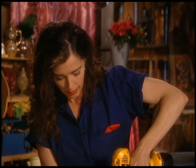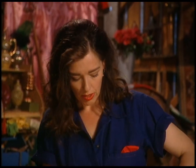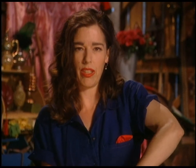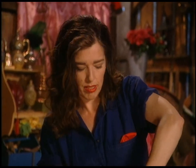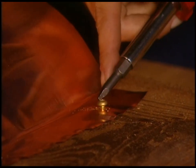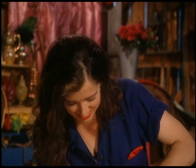Now you've got the little holes, so it's time to drill. It's a really good idea to put one screw in first so the metal doesn't start slipping around while you drill the other holes. Really good advice: never use a cordless drill to put brass screws into anything — there's too much torque and it strips out the head of the brass screw. See, that just happened; it's almost a circle because steel is so much harder than brass. You have to really lean into it with a hand screwdriver and just keep doing those little screwing motions until you're satisfied.